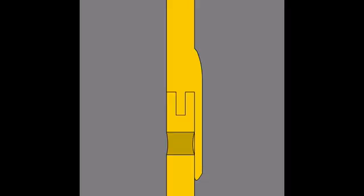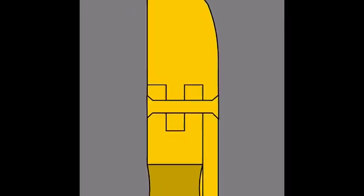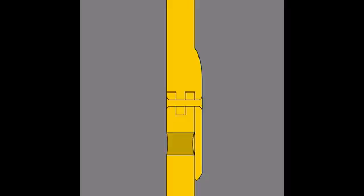And then a hole was drilled through both of the arms, and the ends of the holes are countersunk, and a brass pivot pin is slid in. The countersink on either side creates room for the pin to expand as it's hammered on both sides. And when it's sanded flush, the pin still remains in place because the ends are flared out. And once it's all sanded, it creates a nearly invisible hinge pin. And then the locking arm gets drilled and tapped for a screw. And that locking arm immobilizes the hinge once that screw is in.